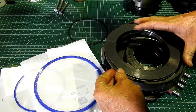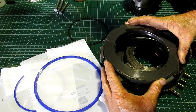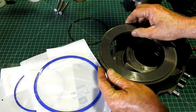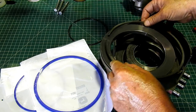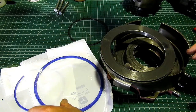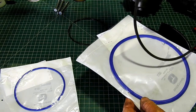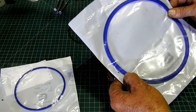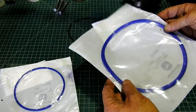Now, they were a little troublesome anyway, because when you have a piston ring sitting like that, sitting together, there's always a gap. And the system was never designed all that well. And John Deere, in their wisdom, they thought, well, if we take a steel piston ring out, we put a neoprene one in, well, this one here has no gap. It's a better sealing surface.